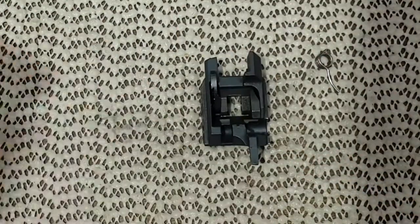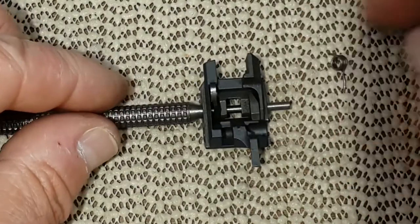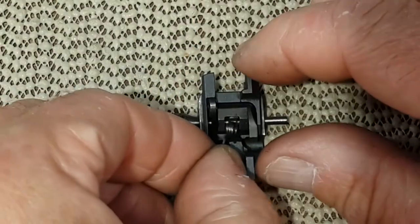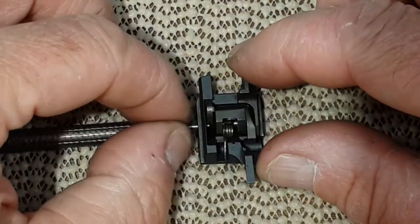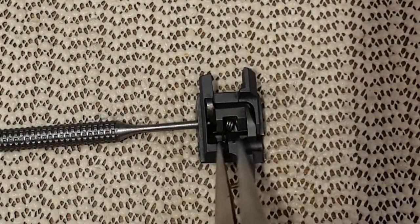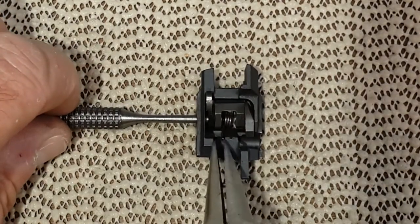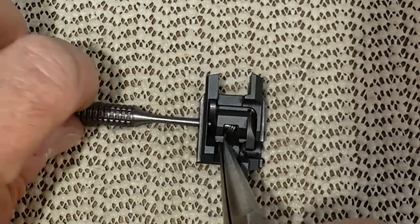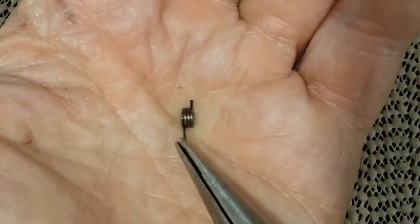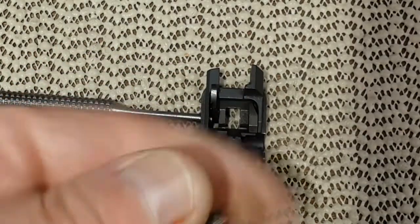From this side I'm going to put my punch and try to capture everything in the process — except I haven't put that spring in yet. So I'm going to have the long arm facing forward right here and retract the punch. That spring went down too far — it's kind of a pain. Well, this is not hard, it's just a pain. You don't want that little arm in the back falling underneath, or you won't have any resistance. That arm is where the pressure comes in, front and back.